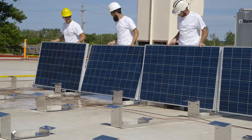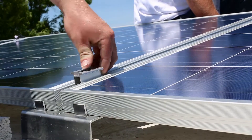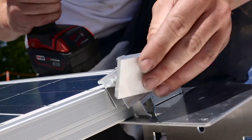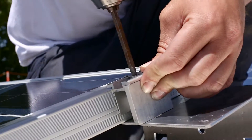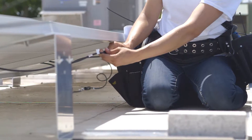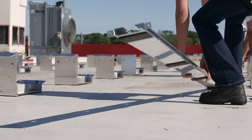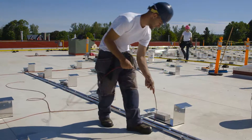The solar panel is then placed on four of the Econorack feet and secured with our ETL certified grounding clamps. We provide custom end blocks to fix at the end of each row for proper support on the clamps. Once the modules are in place, begin cabling the system. String cables can be fixed to the Econorack support using the pre-drilled holes.